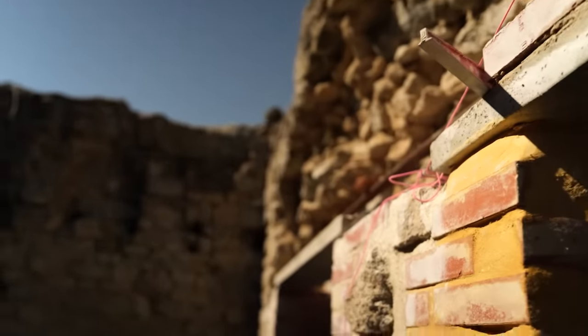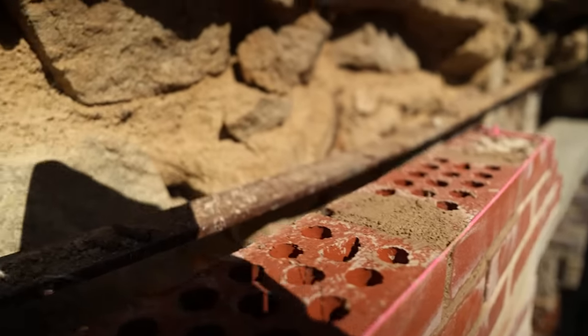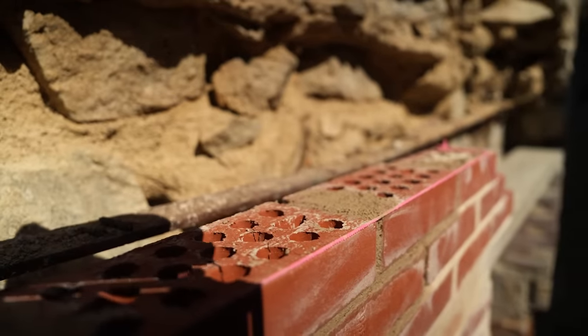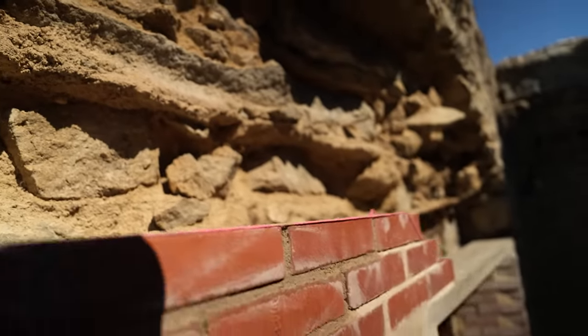So what's happening from here? This line of three bricks is going to go all the way across the other lintel. From this layer I'm going to bond in metal ties that go from the top of the brick to the existing stone wall, and that should create a good strong bond. And obviously infill between the brick and the stone with more stone, which should kind of make the whole thing tied together super strong. Once this dries I think we can get the first i-beam on, which is a pretty exciting thing.